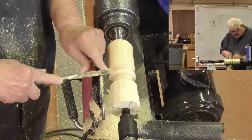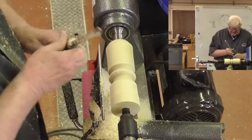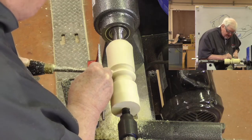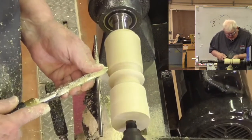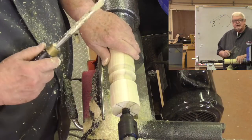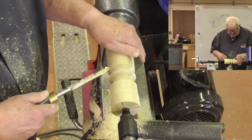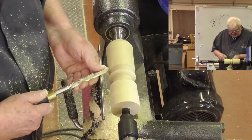To cut this I need to go the other direction. Now I'm right at the point where if I continue up the other side, this edge is going to grab into fibers. I started this cut without that bevel being supported, put the edge into the wood, and it did this little spiraling thing. Because the tool was slightly turned one way it wanted to create a spiral going that direction; if I turned it the other way it wanted to spiral the other direction.